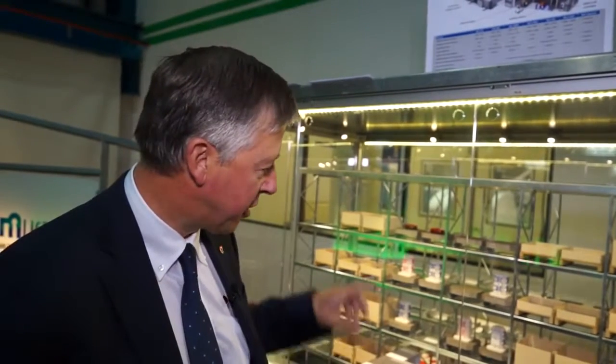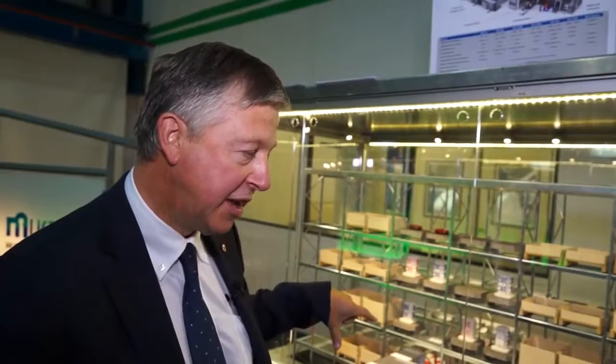To put that in perspective, talking to a customer recently, he was telling me how he has worked really hard to maximise his spindle production and thinks that on a twin pallet horizontal, he's doing very, very well to get between 4,500 and 5,000 hours a year production. So you can see that if we come anywhere near our goal, and we're currently achieving at a number of customers in excess of 7,000 hours per year, that's a significant increase in the efficiency that you get out of your machine.